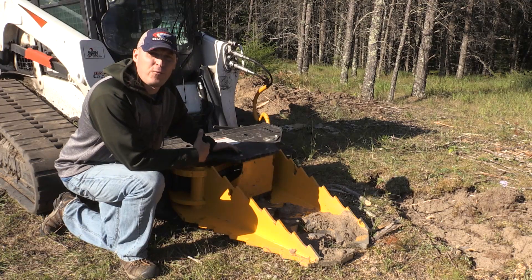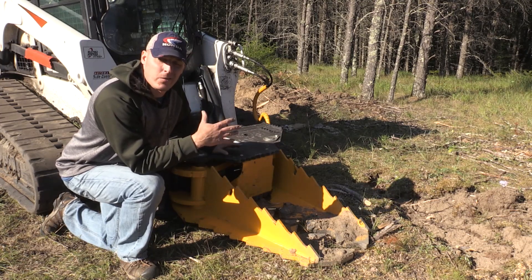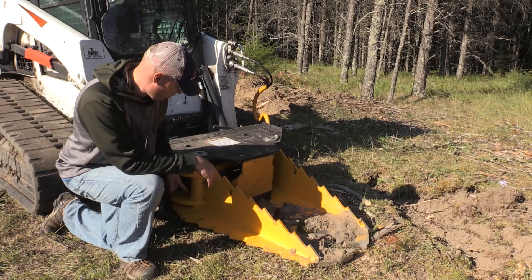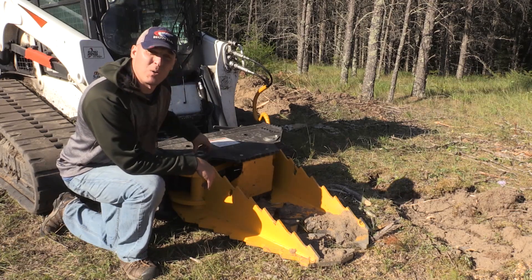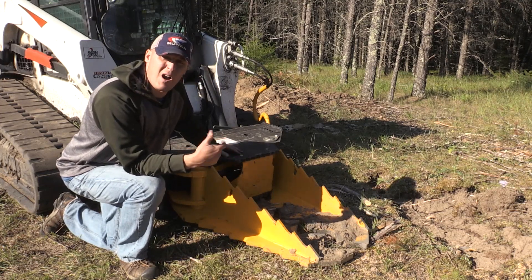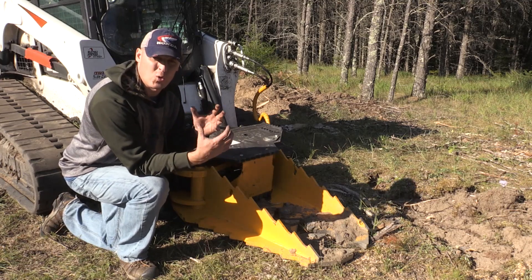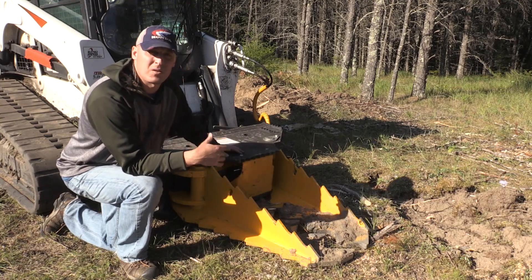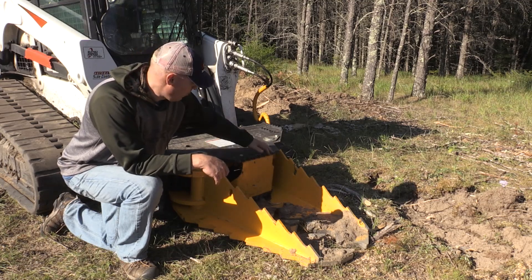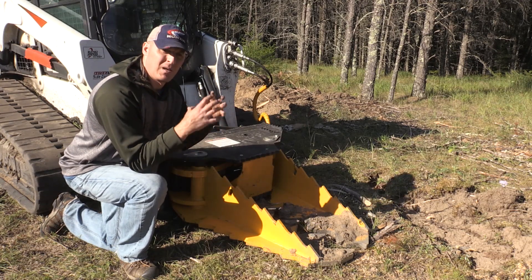I wanted to point out a few more features on this heavy-duty tree puller that make it truly heavy duty and above and beyond any standard tree puller on the market. First, we're using two-inch pins that run the full length top to bottom and they're greasable. Inside the jaw bushing we have replaceable steel bushings — if they wear out you can replace them and tighten it up again. That's really important for something working this hard and pinching this strongly. The frame is made out of three-quarter inch plate steel, and we have serrations on the front so you can rest larger trees against the frame when you pick them up and tilt them.